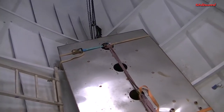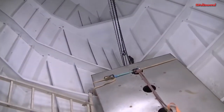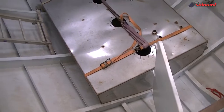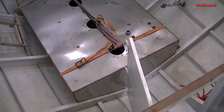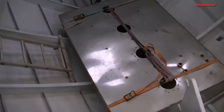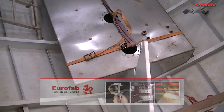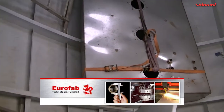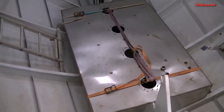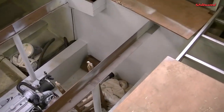I'll be making new parts for that to sit on, and then we will lift it — block and tackle — lift it off, raise it up, continue the painting, sort all the bits out underneath, and get it all finished. There's a hose to go in for an emergency bilge pump and a few bits and pieces, and then I can drop the tank back in properly and weld it in. I designed that tank 12 or 13 years ago and it never, ever came into the boat — it was only ever done off the drawings. It was built here in Eurofab in Dungarvan, laser-cut in Dublin. And there it is, fitting 100%, resting equally on all three beams — so the design works. And that tank can hold 1,200 litres of water, give or take a pint.